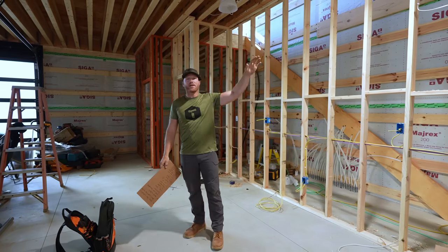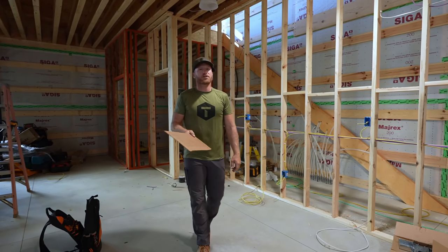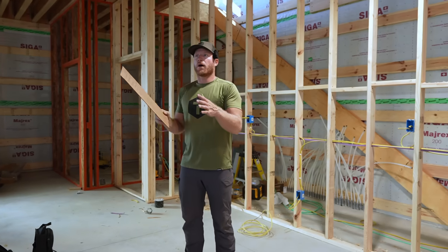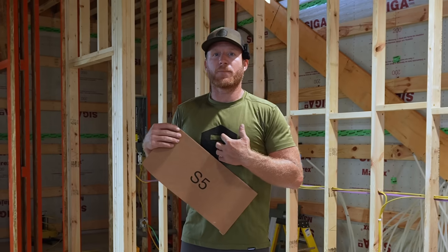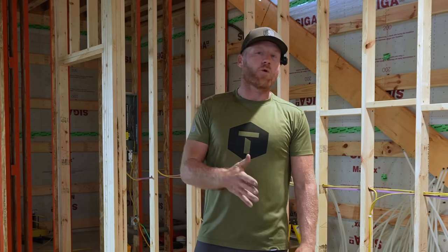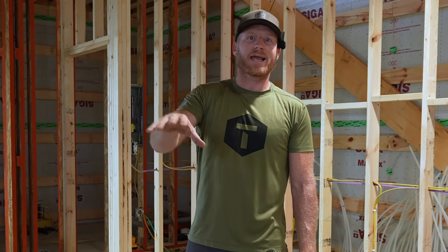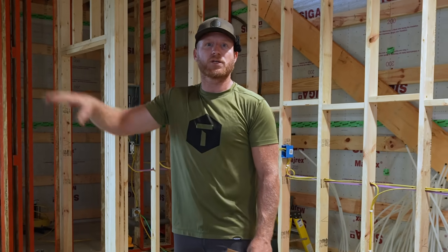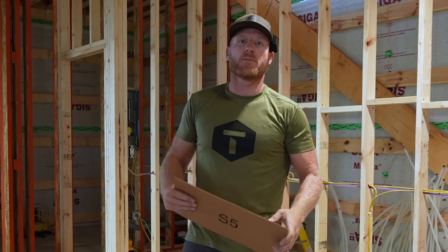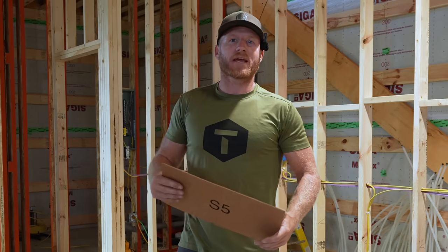So these are high bays. I know that's not what I want here. So please drop me a note in the comment section if you have done a shop or been around a shop. I'm worried about shooting video content in here in the future. I want good lighting. So I've been told to make sure I have a CRI rating of 90 plus, which is the color rendering index, which is basically going to tell me how close to real light the fixture is producing. So the color could seem a little bit off from what is actual. Does that matter? Probably not. But anyway, drop me a comment on that.